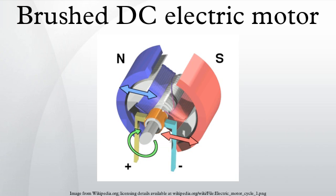Undervoltage motor protection is typically incorporated into motor controllers or starters. In addition, motors can be protected from overvoltages or surges with isolation transformers, power conditioning equipment, MOVs, arresters and harmonic filters.